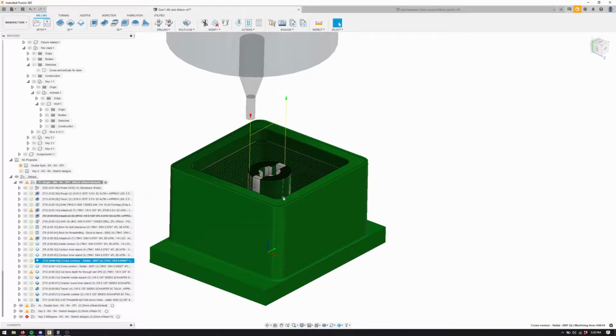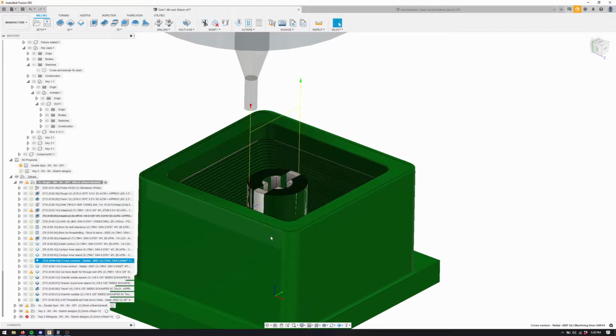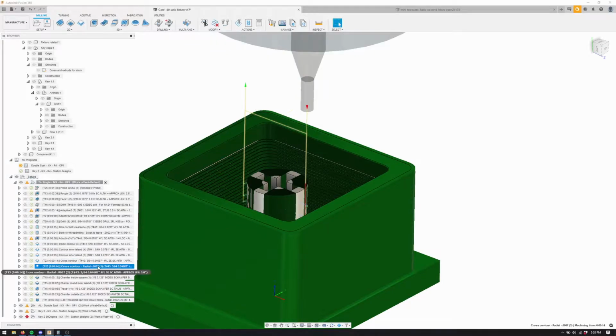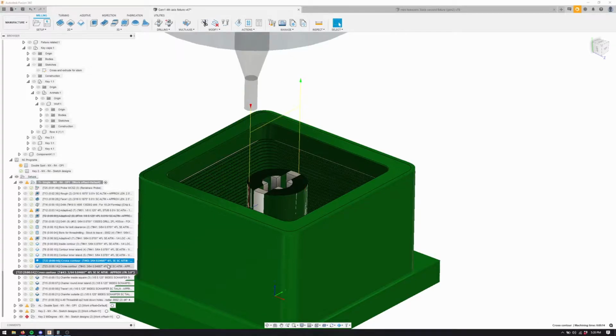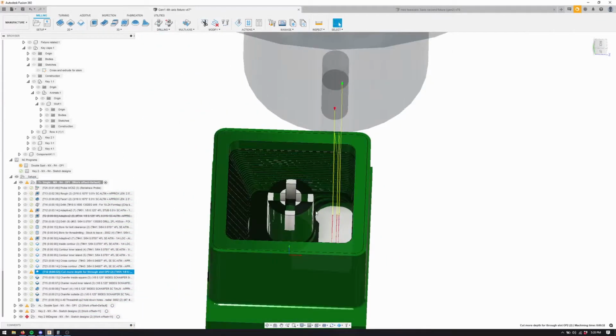I was slotting with a 1/32nd tool before and doing one pass here, and then essentially, what's that? Eight passes? No, four passes. Or four contours, but I bought some 3/64ths cutters, which are essentially a couple tenths away from the actual design thickness of the slot. So I'm gonna give these a shot, and I have some switches to check before they come off of the op one. That way we can just double check that width is gonna be good.